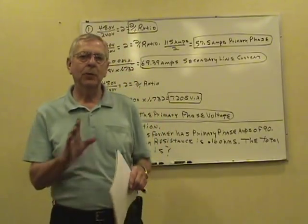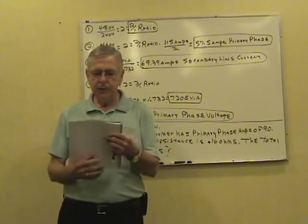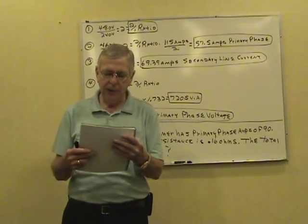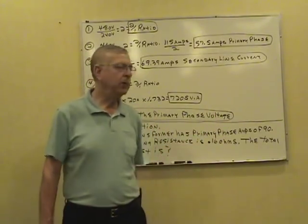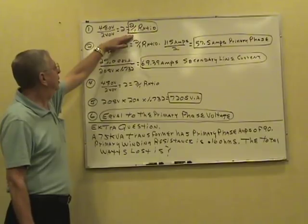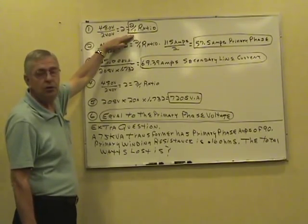Okay, let's go over the answers to page 33. First one's the turns ratio of a 480, 240, 120 single phase transformer. 480 primary, 240, 120 secondary. 480 divided by 240 phase voltage, go two times, 2-to-1 ratio.